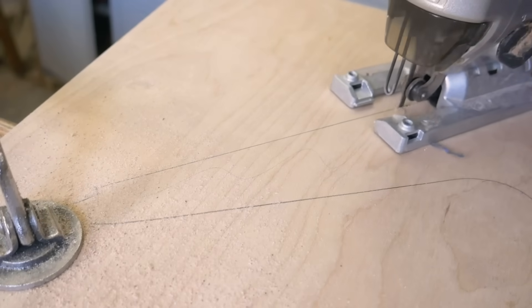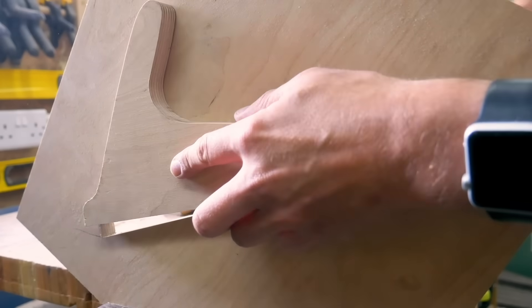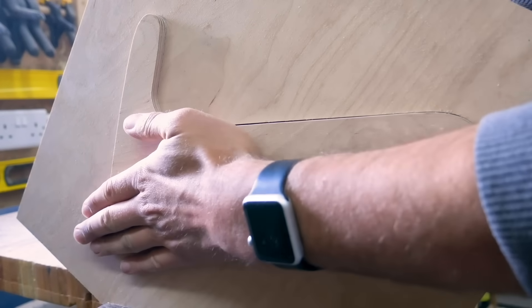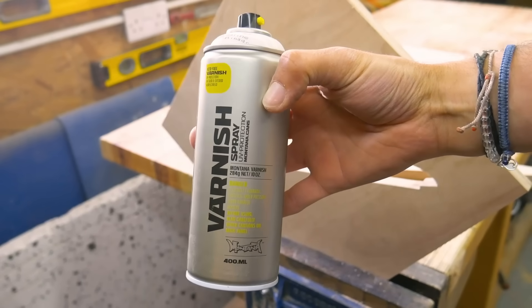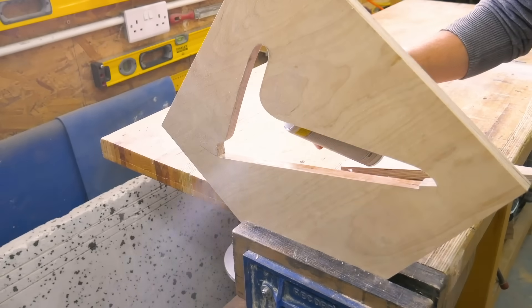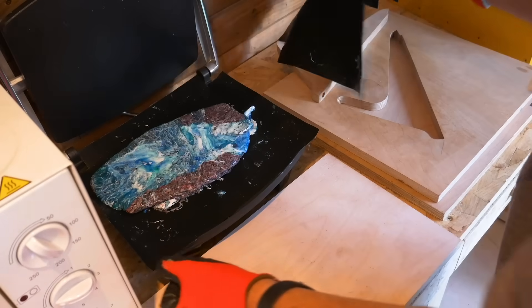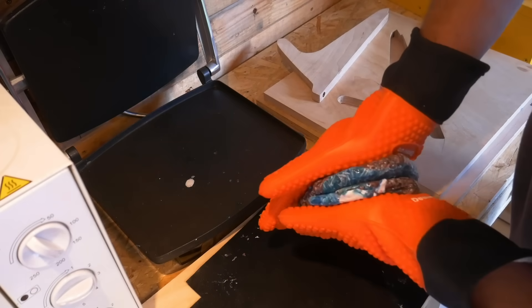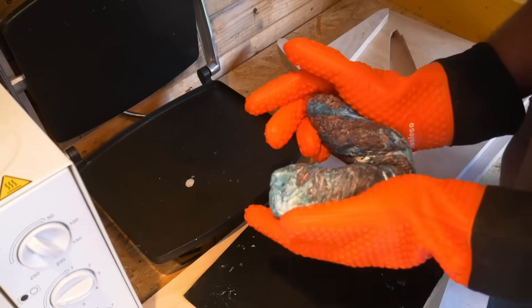The one thing you want to make sure is that you build them strong enough to withstand the forces of the plastic as it cools down. One way to do this is by cutting the shape and a plug out of a flat sheet of material. We also use a little bit of spray varnish and that helps stop the hot plastic from sticking. Essentially you can heat the plastic in any way you want — the tin can trick, the oven on a really low heat, but the most efficient way we've found is the panini press.